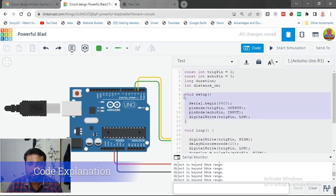In the setup function, which runs only once, we declare whether each pin is input or output. The trigger pin sends the audio signal, so it is output. The echo pin receives the returning signal and measures time, so it is input. We also initialize the trigger pin to LOW so it starts in the off condition.